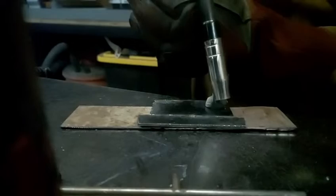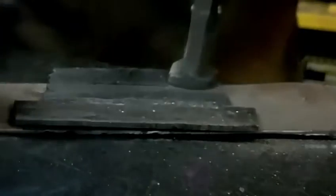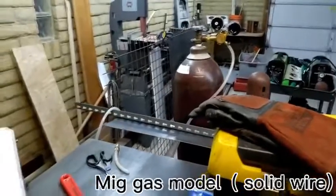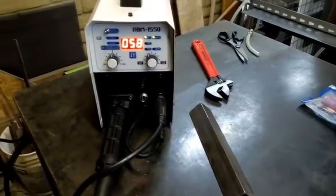Let's see how well we do. It's super easy — it actually works really, really well. One of the things I wanted to test with this welder is how well it'll work with the C25 gas, so I have that hooked up to the machine. I'm still running flux core wire in it. We've got the amperage at 37 amps and the voltage is balanced based on whatever the machine says it should be. I'm going to do a quick bead as if I'm joining those pieces together, grind it down, and see what the porosity looks like and if it's sticking. So here we're going to give it a shot.